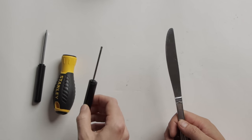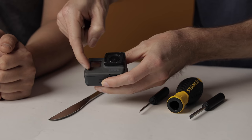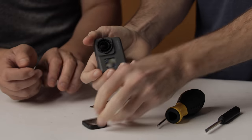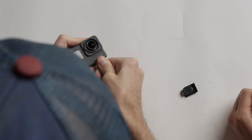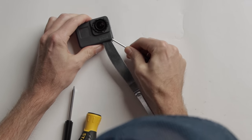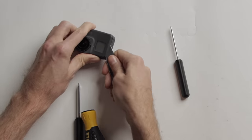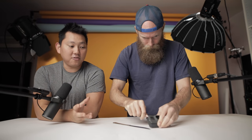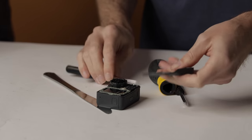For disassembly you need a butter knife and a screwdriver. The main glue is the square that goes all the way around the case — you have to break that bond. Take off the lens disc first, twist it off. Make sure there's no battery in there. Start with the butter knife and then get the screwdriver in there. You can hear it going — the case is coming off. The reason RealSteady works better than HyperSmooth 2.0 is that HyperSmooth stabilizes on the fly in-camera, while RealSteady is loaded onto the computer after you've shot it.